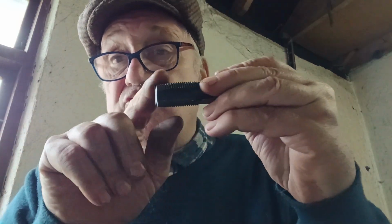Now, they are also designated on the teeth per inch. The thread is 60 degrees, and it has certain topping off, curving off the top. So the thread, the UNC and UNF, is designated by the diameter of the thread and the teeth per inch, and they vary according to the diameter. Are you with me there? So they're Unified. Union, Yankee, as we call them.